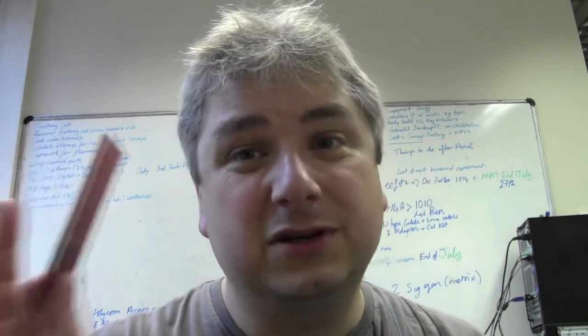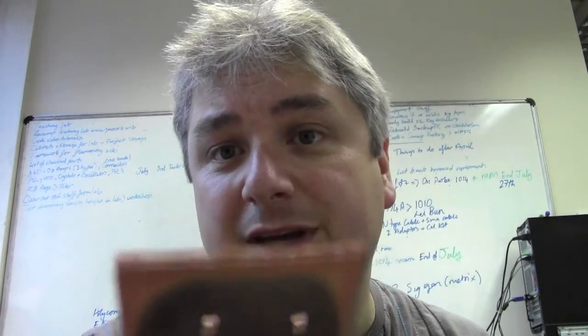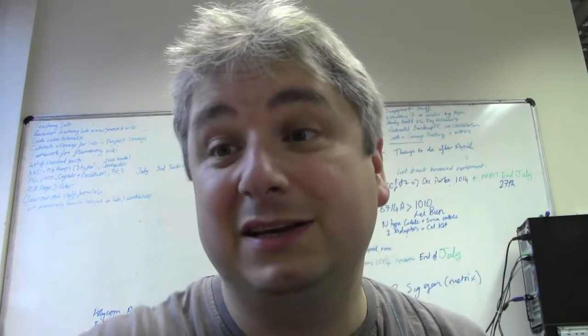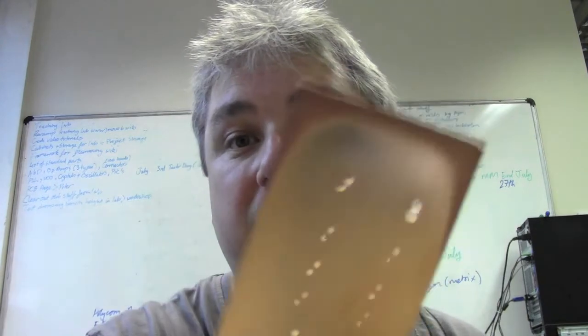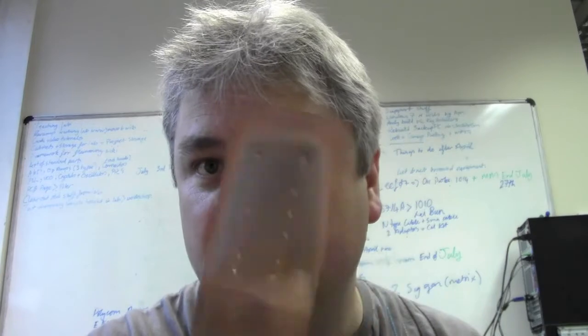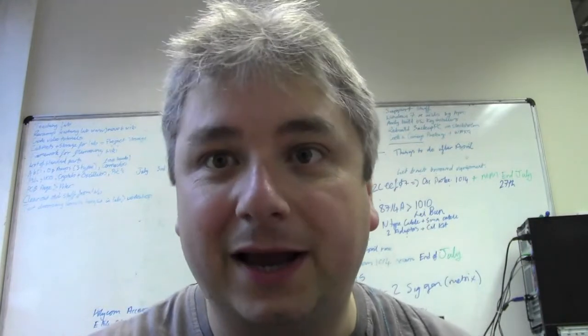It doesn't always work because the finish is pretty poor, but as you can see, this finish is on a poor, roughly cut edge. This was guillotined and hacksawed down that end, and guillotined off either side, and it's doing perfectly fine, no worries. Just like I said, that copper brightener does solve that problem. So if your boards are coming out dull out of your electrolyte, you can get copper brightener. It's available from any PCB house.